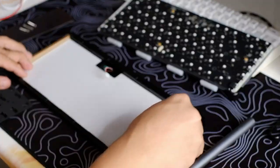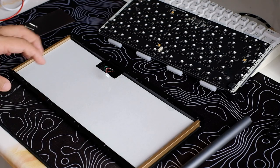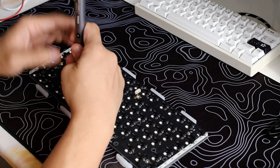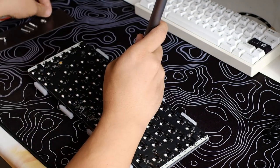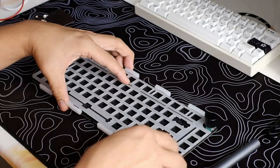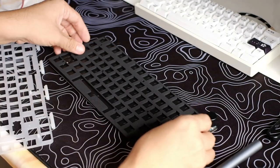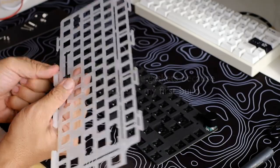On the side of the keyboard, you see two gold bar accents. I did a force-break mod on top and on the bottom of those just to seal in the sound better and remove some of the hollowness. Next, removing the standoffs to access and disassemble the PCB plate assembly — I don't usually use standoffs for my builds, so I didn't use any here. All you then have to do is tune the stabilizers and place everything back together, then add your selected switches and keycaps. For this build, I used lubed Akko cream yellows and the black and pink cherry profile keycaps from Akko, which are really nice.